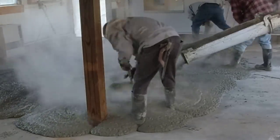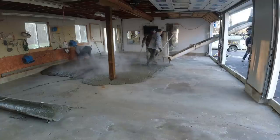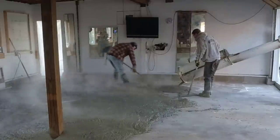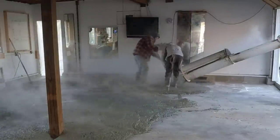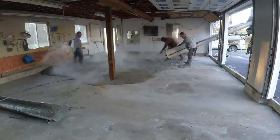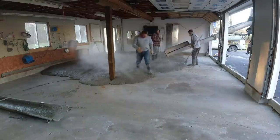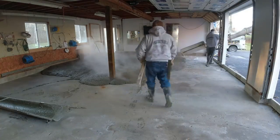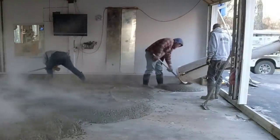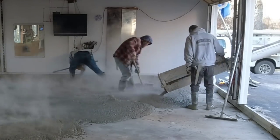There are some places in this floor that were seven inches thick and other places around three, so it was plenty thick enough just to pour over the way it is. There wasn't really any prep that needed to be done. It was basically just like pouring over a gravel sub base — we didn't have to grind it, didn't really have to clean it and scrub it. You don't really have to worry about the new concrete floor bonding to the old floor; it's basically just like pouring a new concrete floor over a really hard sub base that's not perfectly level.